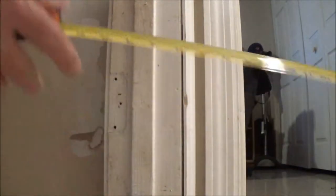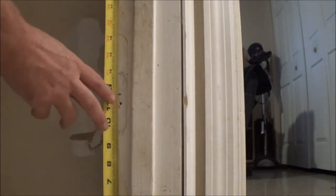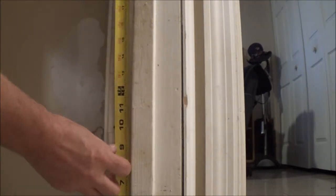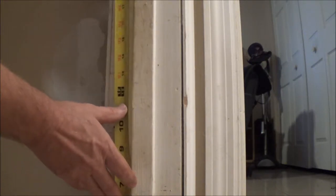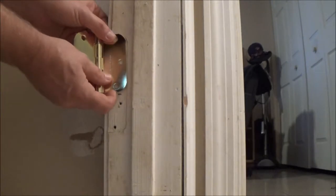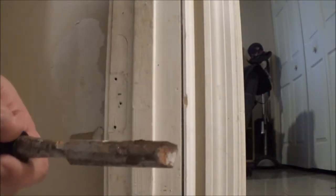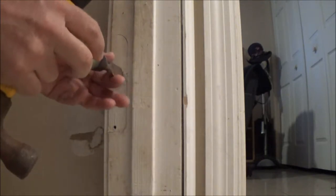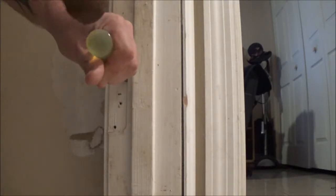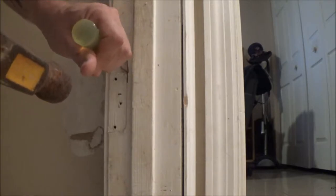What I've done was I measured the other door and measured up to the bottom of the hinge and put my mark there, which is one foot. So I took my hinge and put it right at the bottom of that mark and marked around it. Now I'm going to take my chisel — believe it or not I've only used this like one time, but it was in the trunk of the car and it must have got moisture. I'm going to take this and just chisel this right up around there.